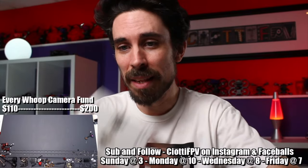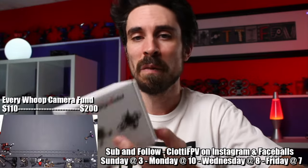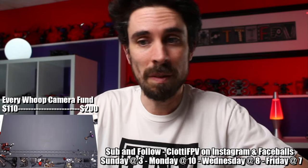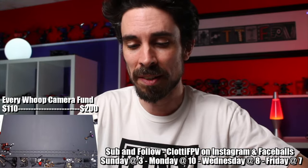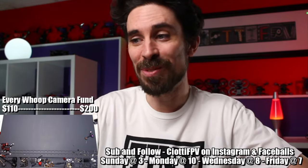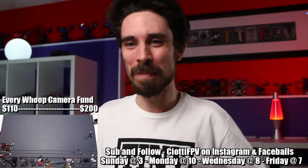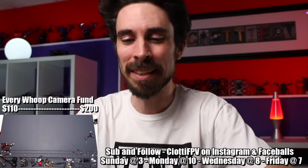If you're thinking about buying a Mobula 6 2024 as your first build, I would absolutely wait for the plug version of it. Because eventually you're going to bang up a motor. These little motors have 1 millimeter motor shafts, and that's just not quite big enough for the amount of abuse that you can easily put into one of these things. So yeah, you're going to be replacing a motor at some point, and if it's your first rig, being expected to solder 30 gauge wires directly to a little tiny Whoop AIO, yeah, that's a bit much. So, very exciting. Thank you, HappyModel, for understanding that and doing that.